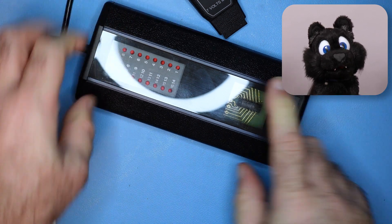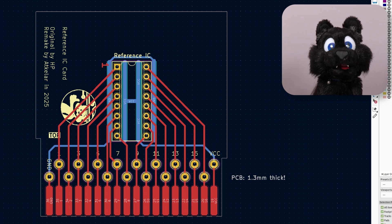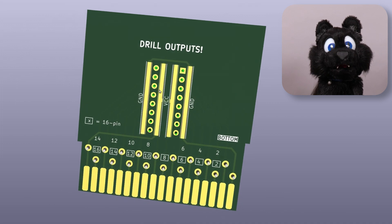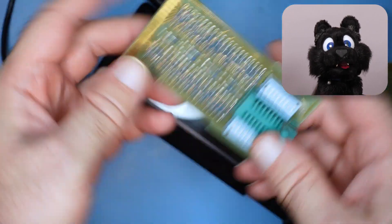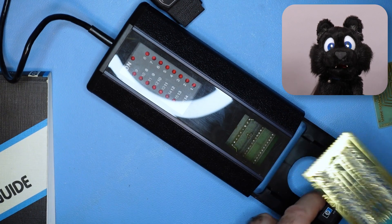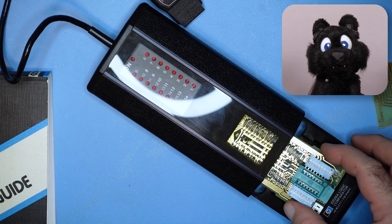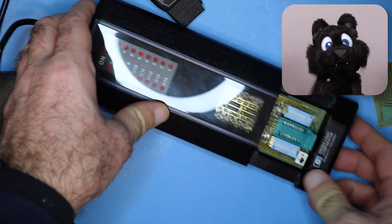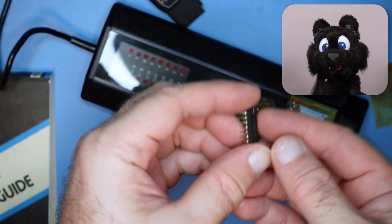While you could order more of these cards, and I even made a KiCad layout, it's not very efficient to carry around dozens of them. HP delivered an optional upgrade for the comparator: a programmable reference card. Note that this is about double the size and contains a load of diodes, as well as a ZIF socket and dip switches. The dip switches take over the role of the drill bit — outputs one way, inputs the other — and the diodes are used to route the power lines.